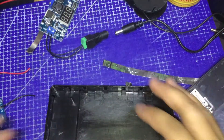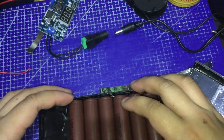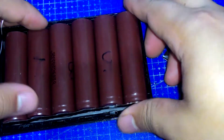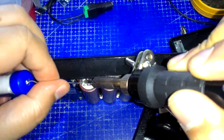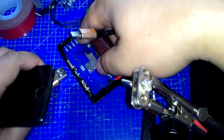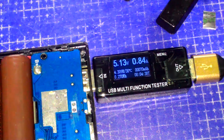Let's see if they will fit inside the enclosure — there you go. Now let's add some double-sided tape to hold the batteries inside the case. While the other device is transferring files again, I'm going to use my other mobile device. Then solder the wires from our module onto the wire connected to the battery terminals — just like that. Now let's check if it's all good. The battery level indicator says it is apparently low on charge, but let's just try it anyway. It's working! Now let's try it with our USB tester connected — currently outputting 0.8 amps. Let's just charge the batteries and do some tests again later.